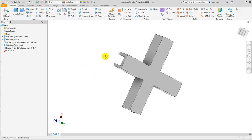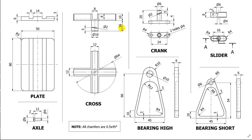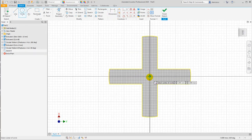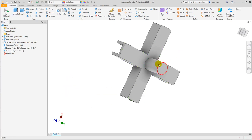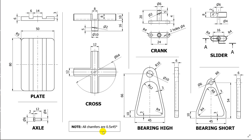On the back we have to add an extrusion. The dimensions are here: diameter of 10 and length 16. Diameter of 10, and extrusion of the circle is 16, okay. I apply a chamfer here of 0.5, which is the general chamfer at all parts. You see here all chamfers are 0.5 at 45 degrees.